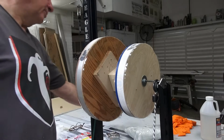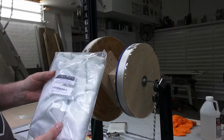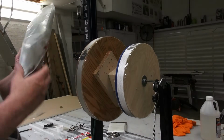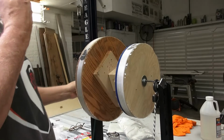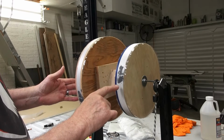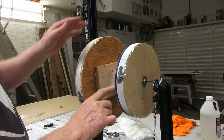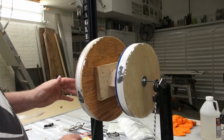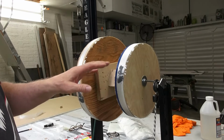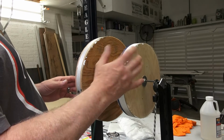And then later I'm going to follow it up with a 6 ounce, a bit of a wider weave. This is more stretchy. This is not very stretchy at all. And what I did, I cut strips about an inch here, and I epoxied the seams here for a butt connection. And underneath is some plastic tape, very thin tape,